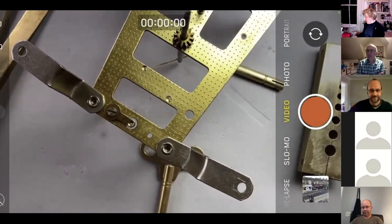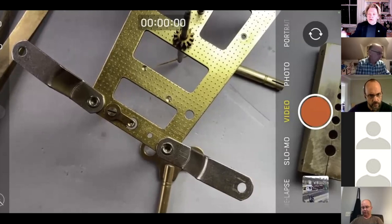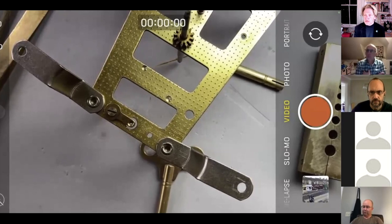Well planted question. I'm sure somewhere I've got 100 of these movements in bits. But yeah, that's our next stage, because as you well know, Rob, the only difference really between a striking clock and the single train clock is the dreaded problem of getting the phase relationship right between the warning and the lifting of the hammer and all that stuff. That's the big challenge of the second clock. So it's useful if the rest of it is kind of the same thing. So then they do a three train, which we're going to get and look at, you know, Westminster striking clock.